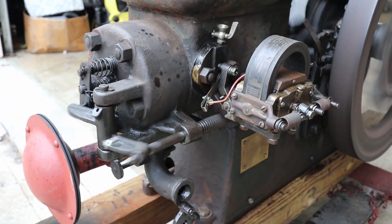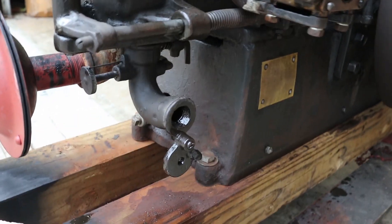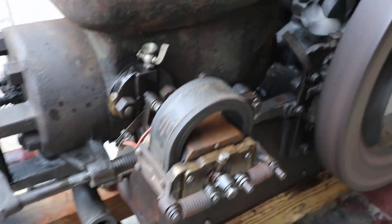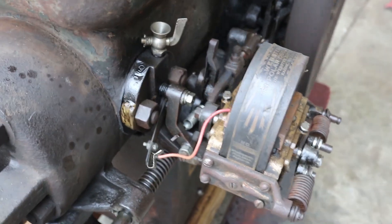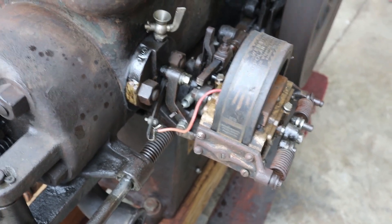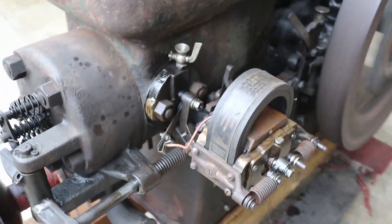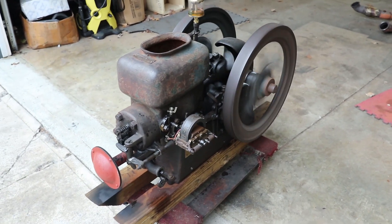When there's no compression, it allows it to freewheel. And then when the speed gets low enough, it closes the exhaust valve, which creates a suction stroke — so it pulls fuel in through the little carburetor here. That gets sucked in through the intake valve, then it's compressed by the piston, and then ignited by the magneto. This is a Webster magneto here. The magneto is actuated by a little bar on the pushrod. As it pushes it, it gives it a little flick which generates a little bit of electrical spark, which then goes to the igniter — kind of the equivalent of a spark plug on the side of the cylinder. The spark ignites the fuel charge and gives it a power stroke, and then the power stroke gives it enough power to freewheel a little bit more. And the whole cycle repeats itself.